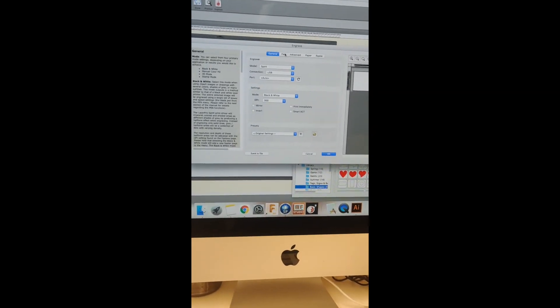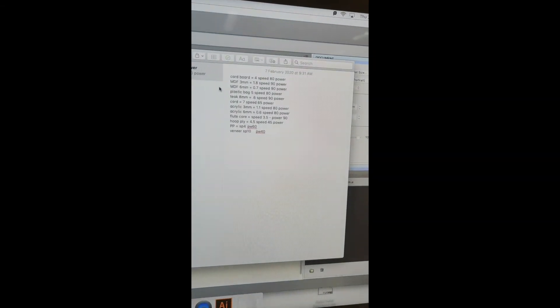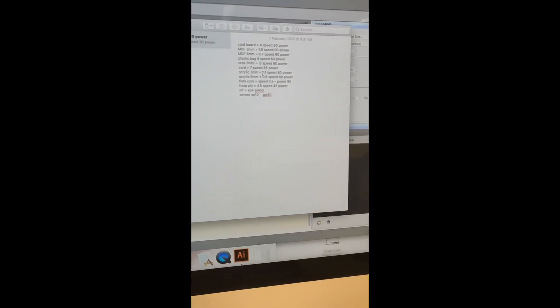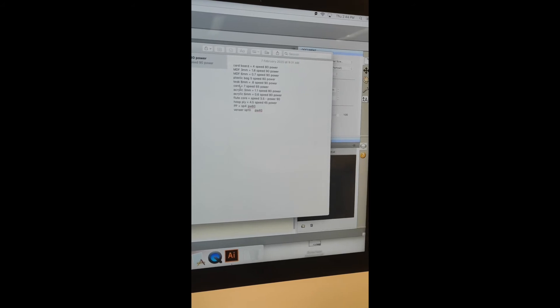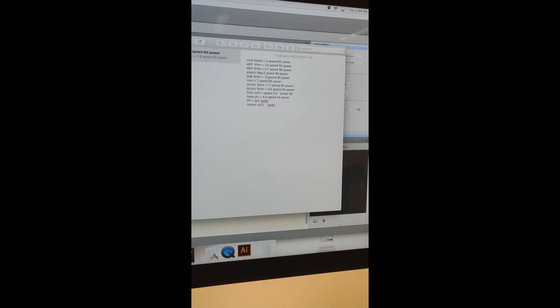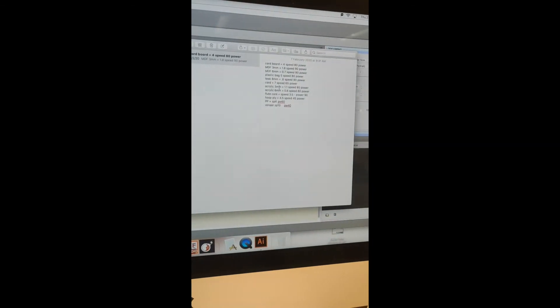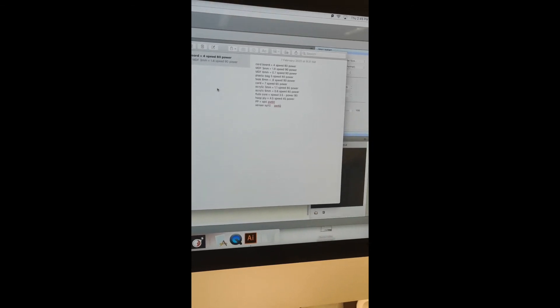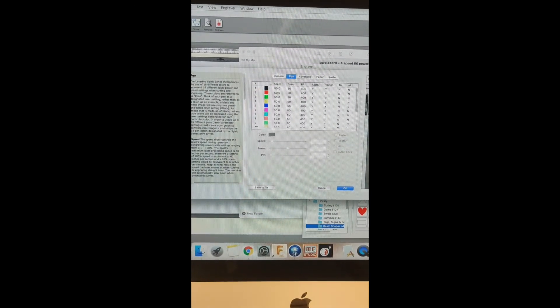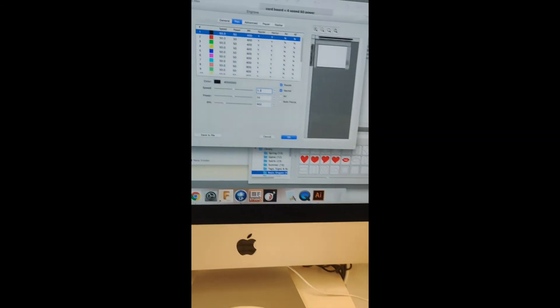In the settings, go to Pen and click Notes. You'll see we have acrylic. Three millimeter acrylic is quite thick — you could use much thinner material, even tracing paper. The material I have is three mil, so the settings are speed 1.1 and power 80. If you wanted to use 1 mm acrylic, you'd reduce the power or increase the speed. The line here is black — if it were red I'd be changing settings. Speed is 1.1, power is 80. Click out of the box to confirm each value.